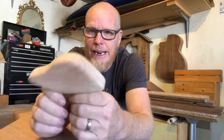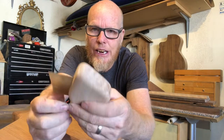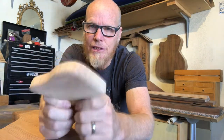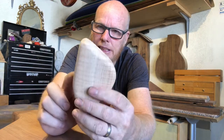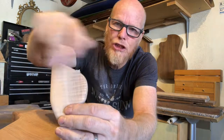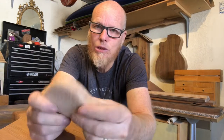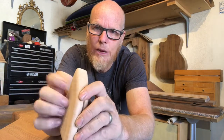What we're going to do, I sanded all these to perfection. There is literally not a scratch or bump or bang in this. We're going to stain these black, just like we did with the other one. What happens when you stain this maple black is it gets into the medullary rays. Ooh, fancy word. That's tubes. Wood is basically made up of tubes. And it gets into the medullary rays, and it stays in there, and then you sand the black off, and it makes these tiger stripes stick out really, really good.